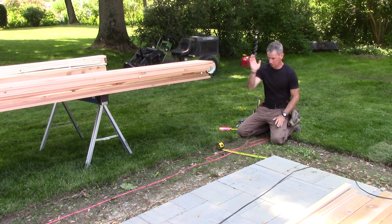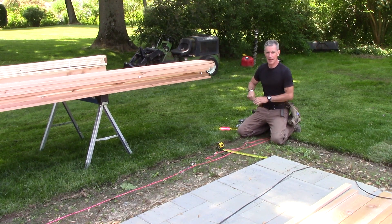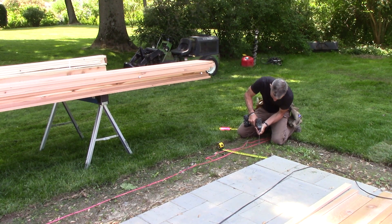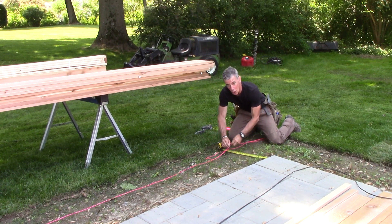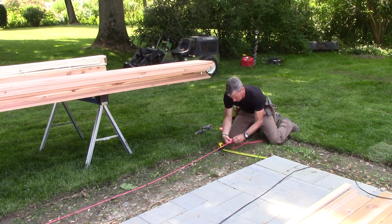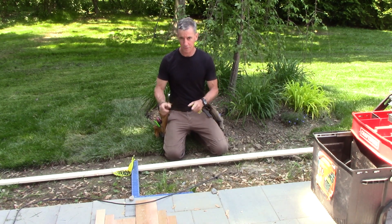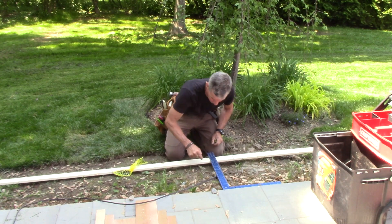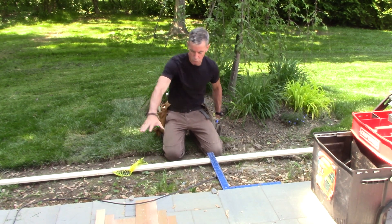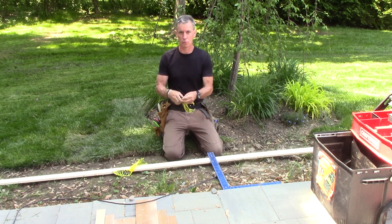Step one: layout mason's line. This design is 18 inches off the patio. I anchor my mason's line with a 5/16 by 6 power lag right on a rock — that's enough. Then to cinch it tight I use the old trucker's hitch, tight but not too tight. I'm using the perimeter of the patio pavers as a layout mark, distances between posts measured. I'm 18 inches from here to here — there's no right or wrong, this is just what's happening here. We're going to do river rock in here as a buffer between the two materials, and I'm using the old caution tape screw-pull marking trick.